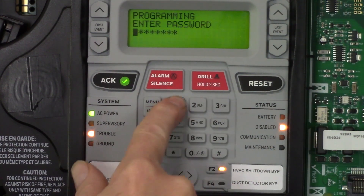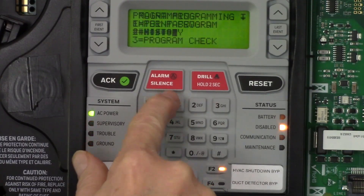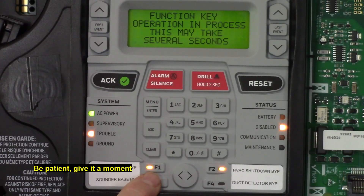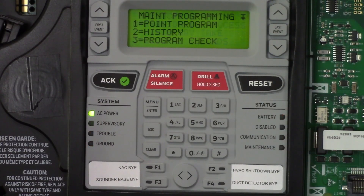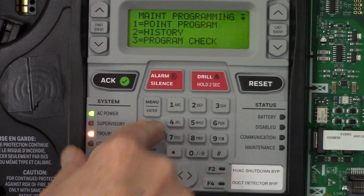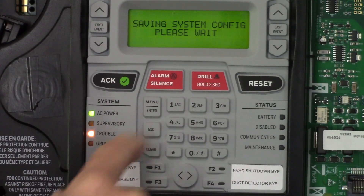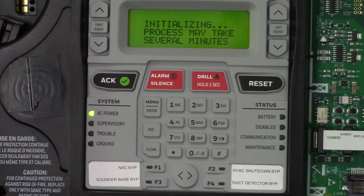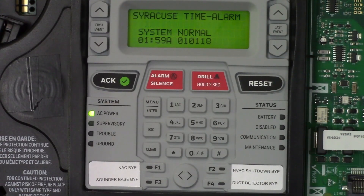To re-enable these, you have to log back in again. Press your menu, go into programming mode, enter all ones again, and you can turn your function buttons off by pressing them. It doesn't happen immediately — when the lights clear you can escape out, and it will save that configuration and eventually return to normal condition. If a module or sensor was bypassed, it may go into initialization, which can take a minute before the system returns to normal.